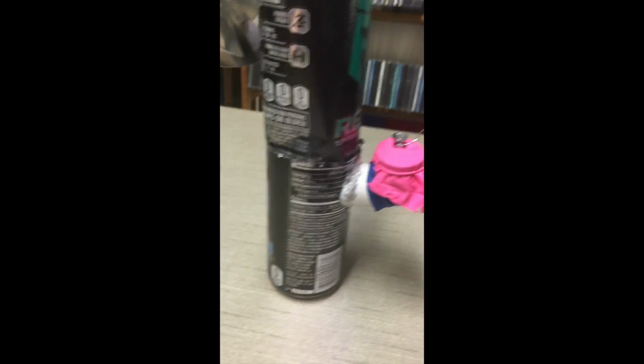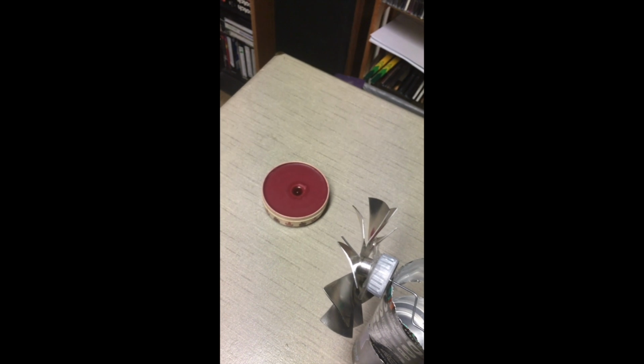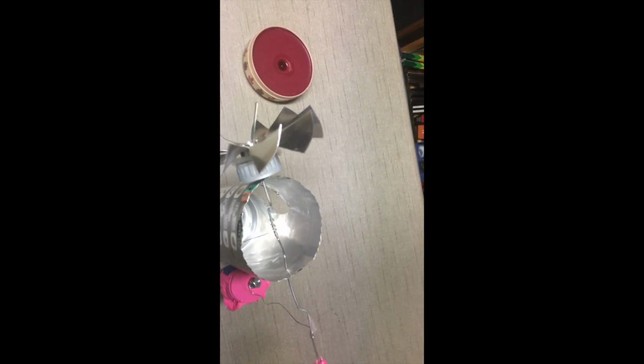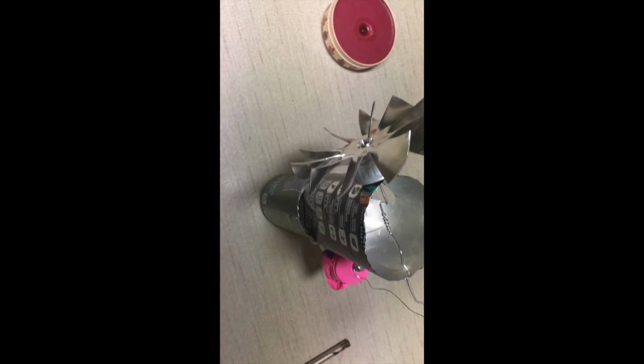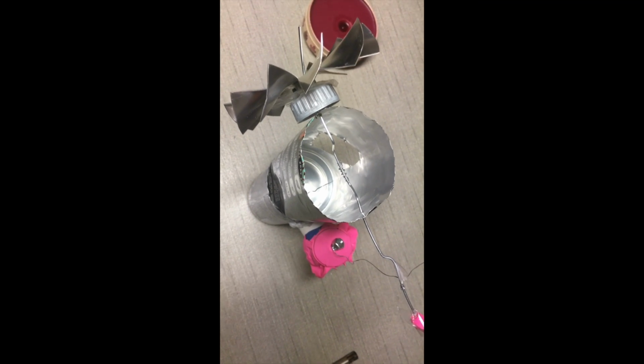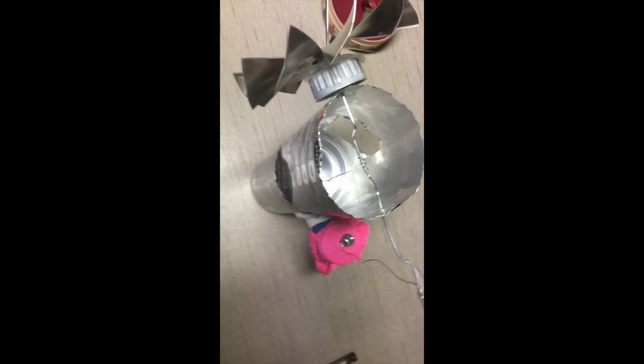So a valiant attempt, but at present it does not work simply off of a temperature difference. But proof of concept, for sure, proof of concept. I've seen many videos of people successful. The crankshaft was designed correctly, and the propeller looks good. The displacer visually looks good. It just doesn't work because there's not enough movement all the way up to the crankshaft.